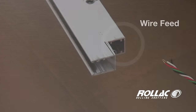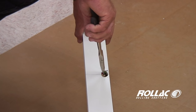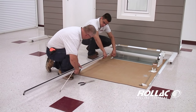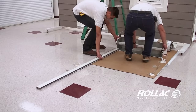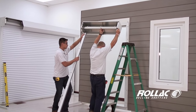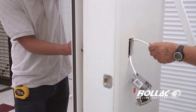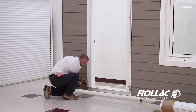Feed the motor wiring through the railing, ensuring to use the enclosed box inside the rail. Use a pair of needle nose pliers to pull out the wiring through the drilled end. Be cautious not to accidentally cut the wire against the drill hole. Reattach the rail and box housing to the rail and wall, but do not secure with screws. Feed the wiring through the drill hole to the switch box. Secure the rail back to the wall with two screws.